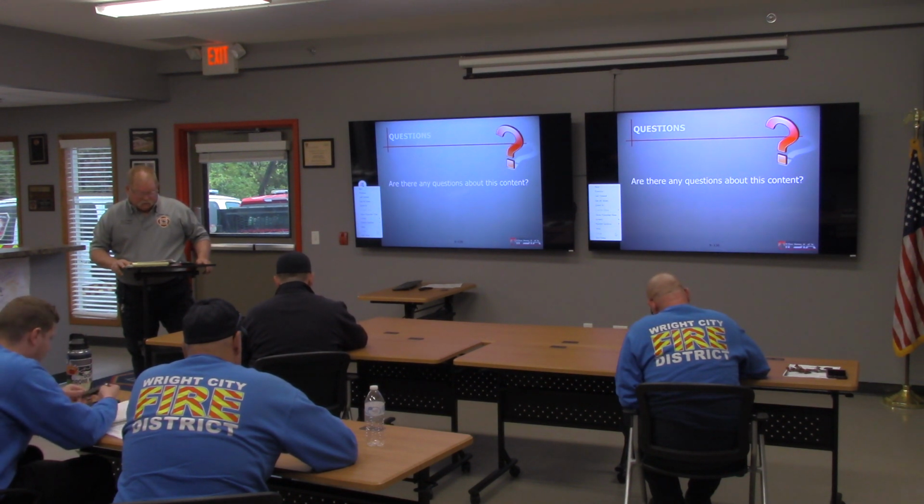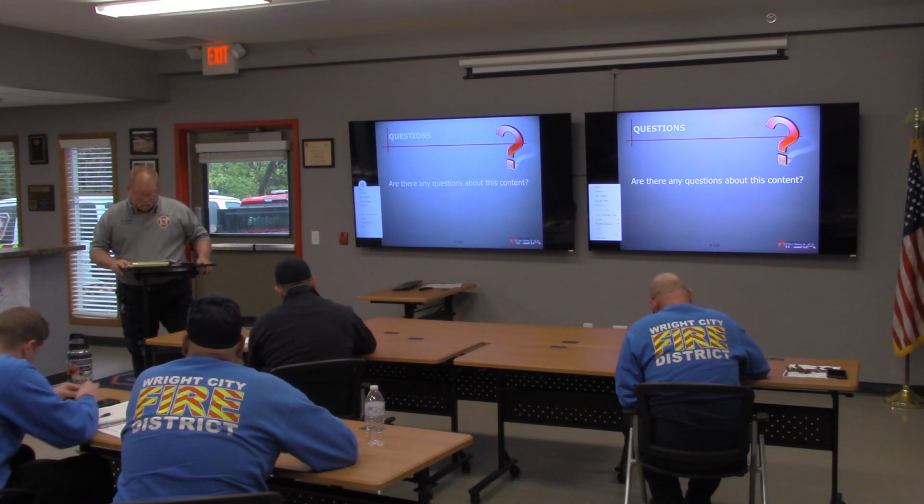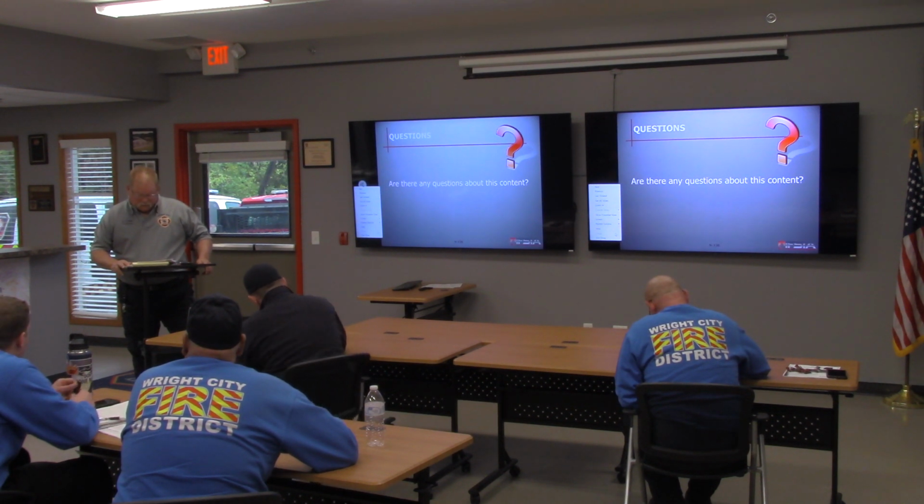On an inward swinging door, we're going to make sure we all wear appropriate PPE. Ted, like I said, we'll do a modification with you being light duty. We're going to choose the correct tools required to complete the task and properly carry them to the door. Correctly identify the type of door to be forced and try the door first. Place the fork of the prying tool just above or below the lock with the bevel side of the fork against the door. Give the command to strike the prying tool when ready. Reposition the prying tool as necessary in between strikes. Then we'll make sure the fork end has penetrated between the door and the door jamb and that approximately 3/4 of the fork end is extended past the door. Then you're going to exert pressure on the prying tool toward the door, forcing it open.